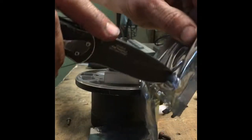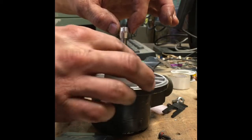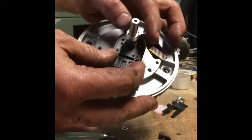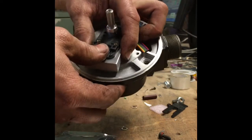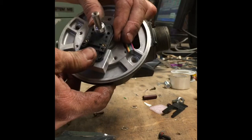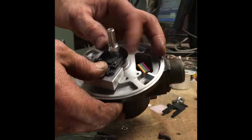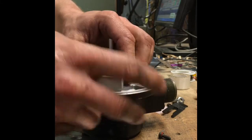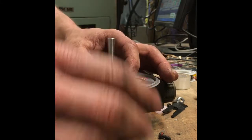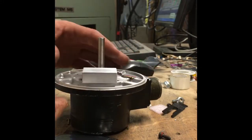I use this little tool right here - a centering device. This slides onto the shaft and down inside this little hole here, and it centers up my encoder. I glue all this stuff together with super glue. I know it sounds chintzy, but because you're using this centering device it's actually very precise. Then I build the encoder and cut a hole in the housing for the cable.